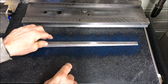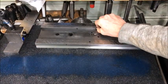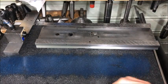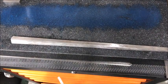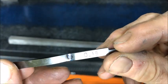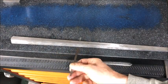Well, yeah, we could. But it is also then, I think, at least advisable to measure up some more, to find out more about, for instance, whether or not we could bend it. Because otherwise you risk it being too shallow, and going beyond what is within the length that you can adjust. I ended up having to back it up anyway, but just for the sake of it, I can use various methods to find out that it's hollow. I use a 15 hundredths of a millimeter shim here, and that easily goes underneath there. So it's proof that it's hollow. And as I said, it's better to bend it back again than to just start scraping it.